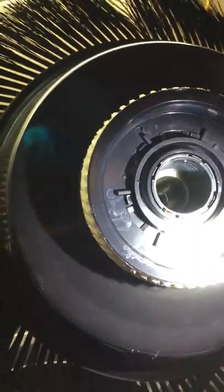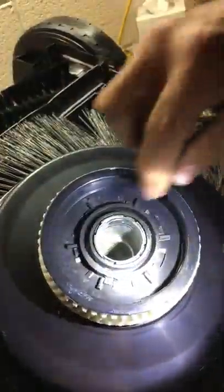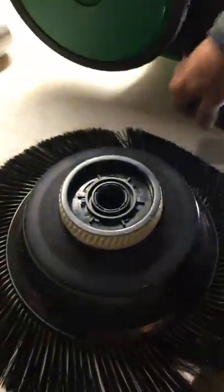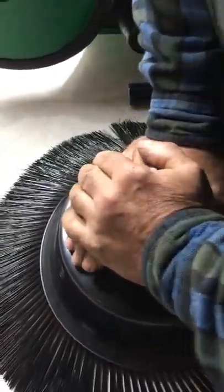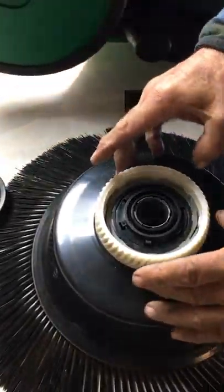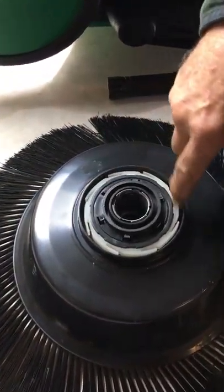To replace the tooth wheel, if you look on the inside you'll see the locking mechanism. There are six tabs that lock this in place, and it locks either left or right depending. This one is locked turned to the right, so you want to unlock it to the left. Put it on a flat surface, push down with the palm of your hand, and you'll feel the ring rotate and unlock. Then you can remove the locking ring, the tooth sleeve, and inspect your clutch.